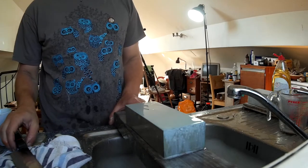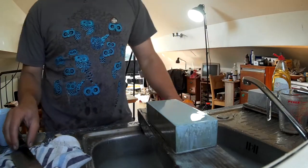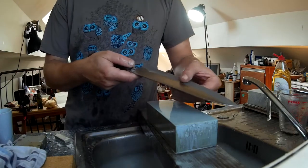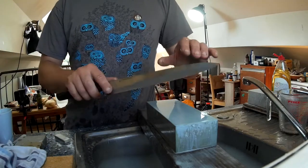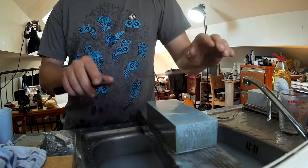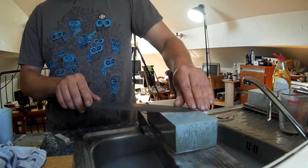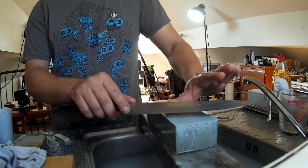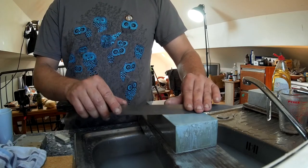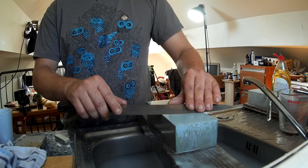Setting the bevel is probably the trickiest bit with this particular knife, because for the rest of the geometry you just follow it by putting pressure on your finger. What we're going to do is find that initial bevel and come up to a set angle. Use your thumb as a rough guide — it's not too important as long as you're reasonably consistent through the bevel.